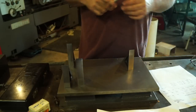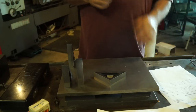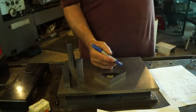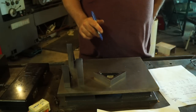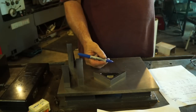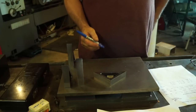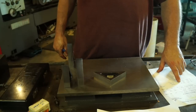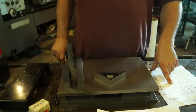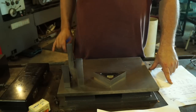This one is B4. This one was probably the better one of all of them — the 45-degree angle. I wish we'd marked them as we were checking them, but anyway, the 45-degree angle turned out to be 44.9987 degrees, which translates into 44 degrees, 59 minutes, and 55 seconds. That comes out to roughly 83 millionths — so one of these 45s is within 83 millionths over five inches.